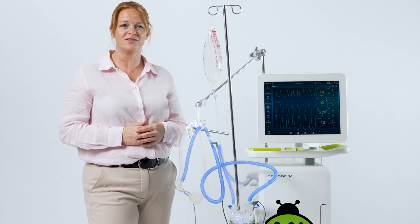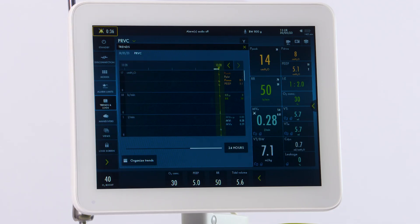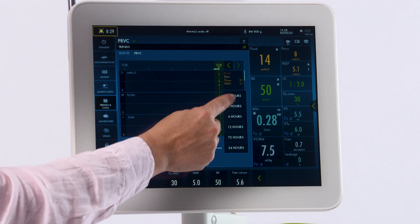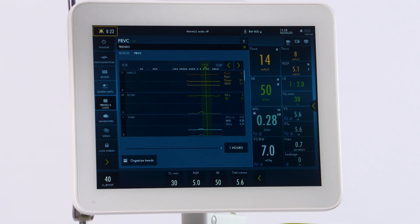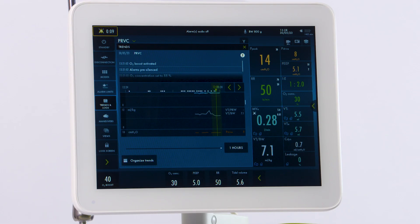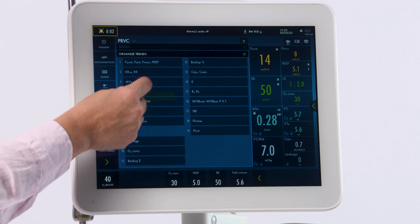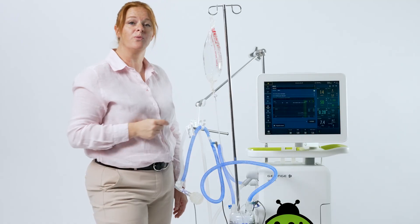The trends and logs are located in the menu screen. Select trends and logs — at the top will be your trends. You can look anywhere from an hour up to 72 hours of time by selecting on the side. You will notice your trended values. Wherever your cursor is, those are your numbers. Gray hash marks at the top mean an event occurred — you can touch them and it will list all events in that minute. Simply scroll through to see different things that are trended. If you would like to reorganize those, select organized trends. You can touch and drop in order to move things, and they will then be rearranged.